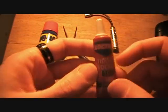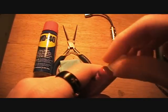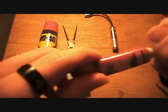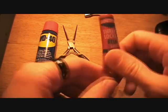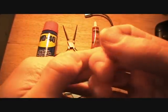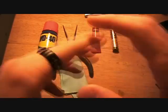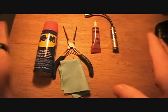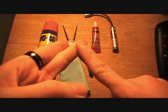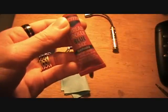Which is why you can get this — the blue Loctite. I've heard a lot of people ask what's Loctite. It's basically screw glue. I did a really crappy job cutting that tip off, so it all comes out in a big blob. There's just this blue gunk that you put on the threading of a screw, and then you screw it in to the hole, and it seals it. The blue Loctite is what you want, because it will securely glue that screw inside the hole. But you can still unscrew it with some tension — it will not come loose by itself.